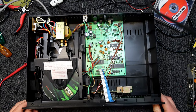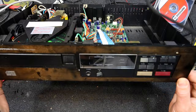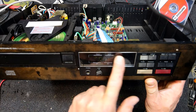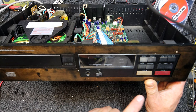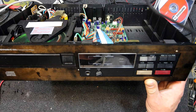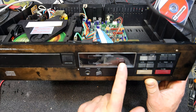This has a couple of issues. It actually seems to play a disc alright. But the two issues are this display - it's kind of like the multiplexing is running slow on it or something. I think that's meant to be saying 20 tracks. Sometimes track one seems to light up fine, but then when you start playing it you get all these lights blinking.